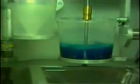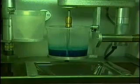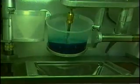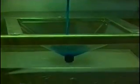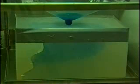With some resins, there may occur reactions due to escaping gas after the two components have been mixed together. The resin must therefore be calmed by a shot of pressure, which is effected using the go-to function. After this, the mixture is poured into the mold through the funnel. As soon as it starts flowing out of the risers, the process is stopped by pushing the stop button.